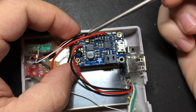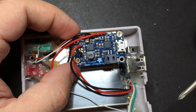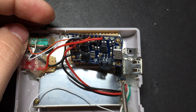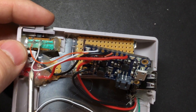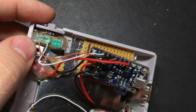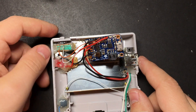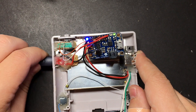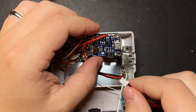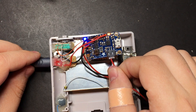I've got the power switch hooked up to the enable pin. Micro USB charging is going to the USB and ground pins, and one of the USB power outputs is going to the external USB port. Before you wire this up, take your multimeter and double check to make sure the wires aren't shorted and that the switch is behaving as you expect. The switch is a little counterintuitive — when it's to the left meaning it's off, you want those two wires to actually be connected, because we put the enable pin to ground which turns off the system. When you're ready to test it, make sure your switch is on and then plug in a micro USB cable. Double check that your switch works, connect the battery, and make sure it charges the battery. Looks like we're all set — go ahead and mount this to the perfboard.